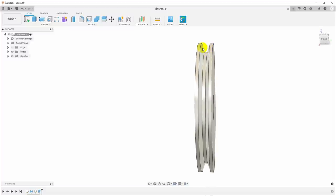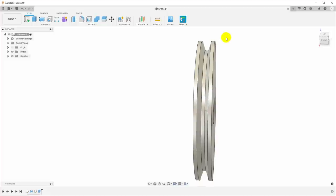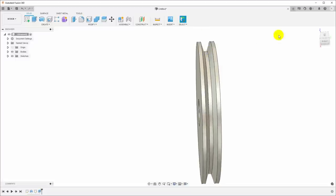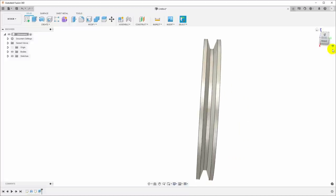You can do the same thing by wedging a couple of pins into a dovetail and measuring the distance between them, and then using the same tangent measurement and drawing your two pins with different diameters. That works for dovetails, and really any case where you've got a V-shaped groove, you can put a pin into it and then take a tangent measurement across those pins or between those pins to control that dimension.